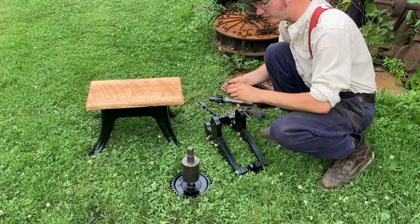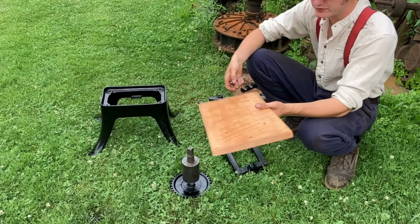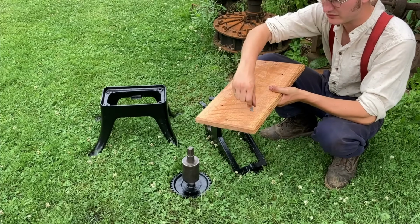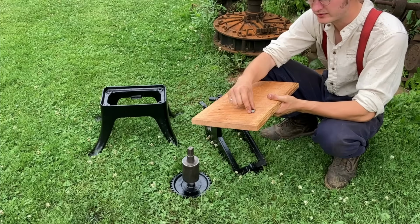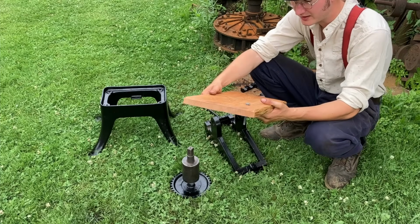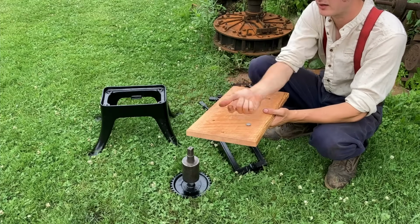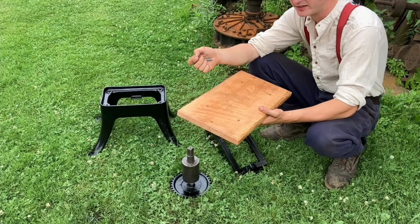Have the carriage bolts for it that are measured out. A lot of people don't like carriage bolts, but if you figure how to put the perfect size drill bit and then tap them in there, the square shanks lock them and do a very good job. As long as the wood doesn't get all rotten, that's a whole other story. So carriage bolts there, up from here and here to mount to the base. Let me go ahead and put that together.